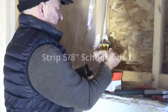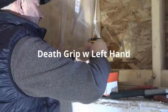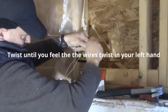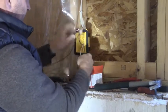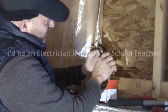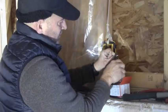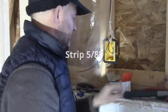I line them up and take a tan wire nut. I put a death grip with my left hand and I'm twisting until I can feel the wires twist in my left hand — good contact. Now I strip the white wire — this is the neutral — five-eighths of an inch. If I was going to be anything other than a school teacher, I think I'd be an electrician.